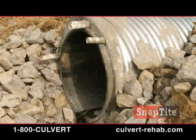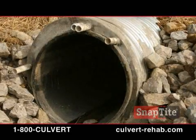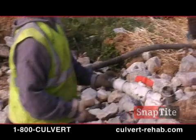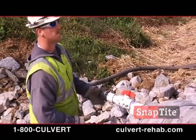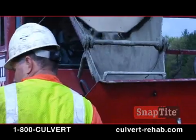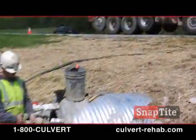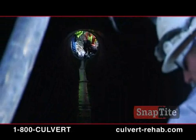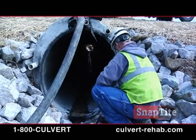At this point, each end of the culvert around the new pipe is sealed with a concrete bulkhead, into which different lengths of PVC pipe have been inserted down the length of the culvert. These sections of PVC will deliver the grout to the inside of the area, around and above the new pipe. Hose couplings are attached to the PVC pipes. The low-density cellular grout is mixed at the work site. Hoses are attached, and the grout is pumped into the voids between the pipe, culvert, and roadway, providing a truly rehabbed closed system. Even though the diameter of the newly inserted pipe is smaller than the original pipe, the rehabbed culvert will have the same or greater flow than the old culvert, thanks to the properties of HDPE pipe.